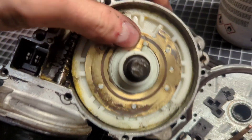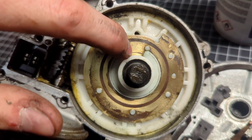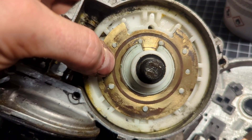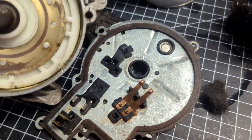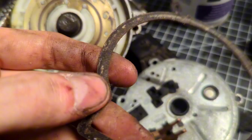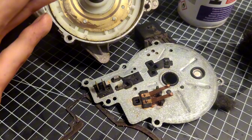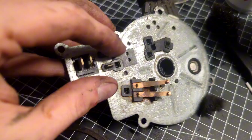I tried my best to clean this — it's a little annoying because it's gold plated. Here it used to be gold plated and it's all gone. I also cleaned these terminals with Scotch-Brite. The gasket is quite poor but I don't see myself replacing it, so I'll clean it as best I can and put some silicone on there.